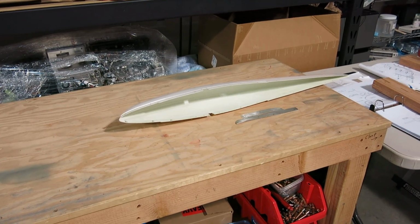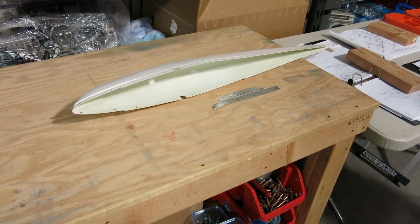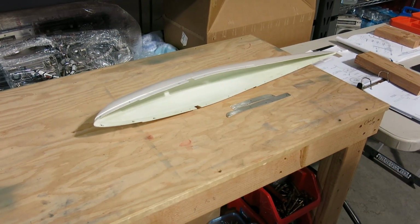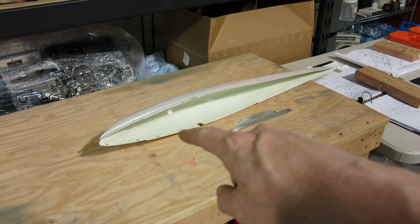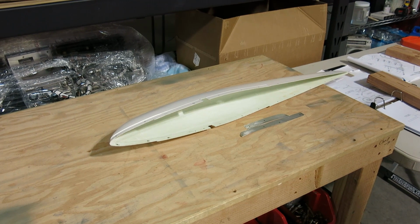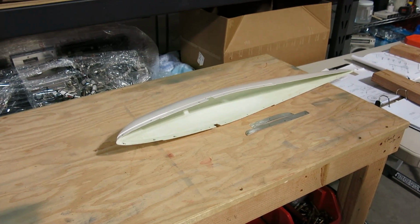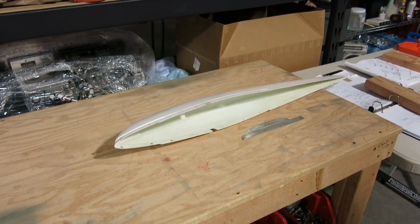vertical tip and those two spacer strips that we made there to match those rivets. So I'm probably gonna whip up a little bit of JB Weld or epoxy, and we'll stick those inside of there, clamp those down, and then we can drill those out. Once that cures, we can put the tip back up on the top.